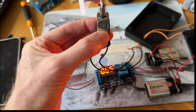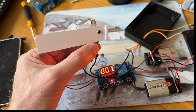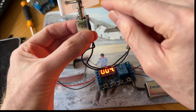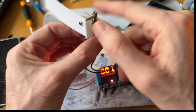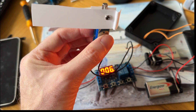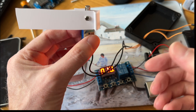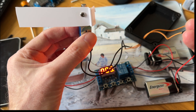Here's a close-up of the circuit and the lever, which is basically a bit of plastic screwed onto the end of a 12-volt solenoid. I'm testing it with a 10-second interval. This is the relay circuit which I've now replaced with the more stable dual MOS circuit. I've got two 9-volt batteries powering it directly, and the solenoid load is on an 18-volt power supply — a bit high for the solenoid, but more convenient than a proper 12-volt supply. Please don't copy this approach for a college or university project or you'll probably get an F.